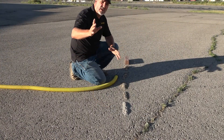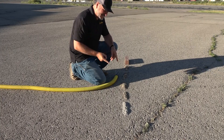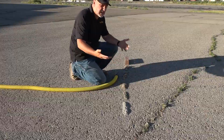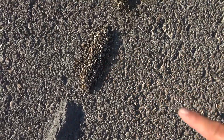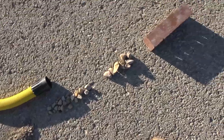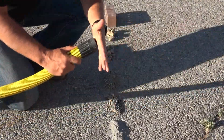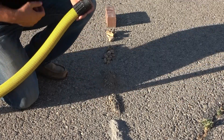A little while back we did a YouTube Short with this exact test using a 12-foot hose. Now we're going to try this with 100 feet of hose to see how hose length affects vacuum performance. For this test we have fine concrete dust, small rocks and pebbles, dirt with rocks, small rocks, bigger rocks, and finally a brick. At 100 feet we're at about 50 CFM and 84 inches of water lift.